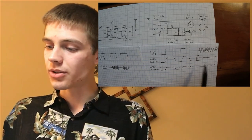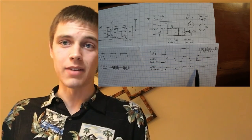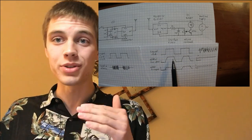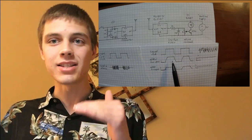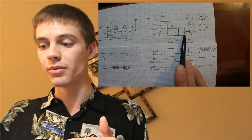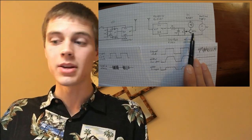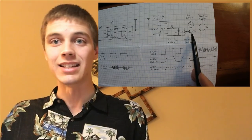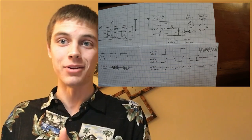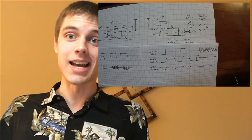So when you are reading noise, it averages out, and then it divides that down, and that divided average turns out to be below the threshold for turn-on. And when you have the actual signal going through, for a portion of that signal, this capacitor has time to fully charge, which means that even after you put it through the voltage divider, it's going to be above the turn-on threshold of the transistor, and you're going to get noise. And that's basically how this thing can tell whether you're sending it a signal or whether the foot pedal isn't depressed and it's picking up background. And that was a reasonably hard thing to figure out, but the circuit to do it in the end is actually extremely simple.